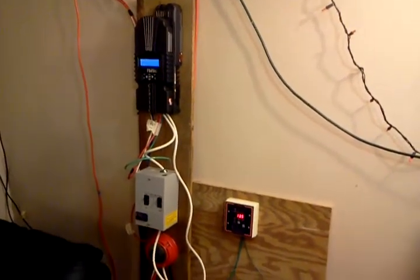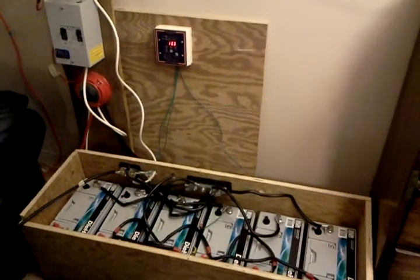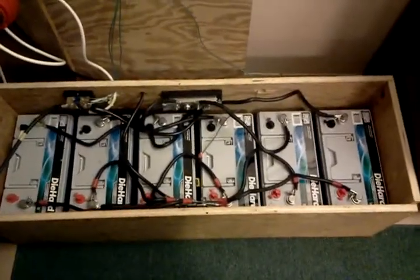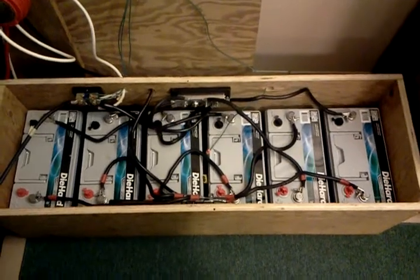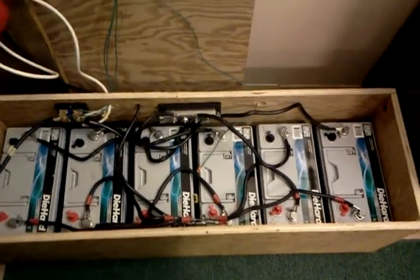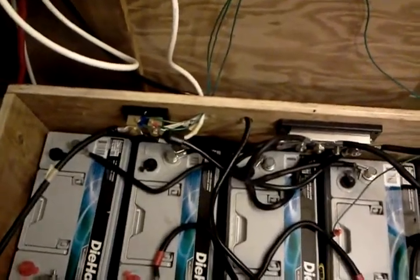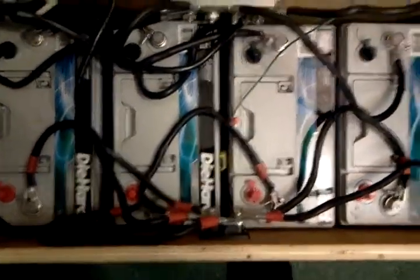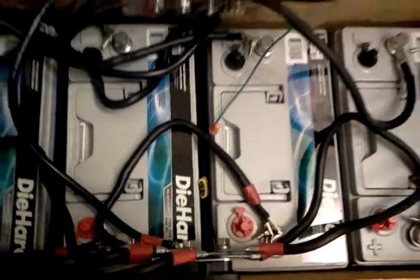One more video this morning, the following day from my first video showing the inside of the battery box and how I set things up. It's a little bit neater inside, but the key was just being able to cover up the wires with a lid and keep everything contained. I've got the negative bus bar in there, the shunt for the Trimetric, the positive bus bar on this side, and a yellow fuse down there for the Trimetric.